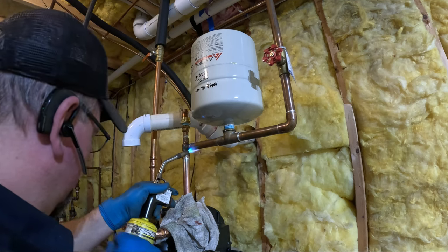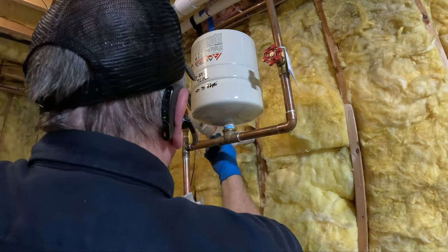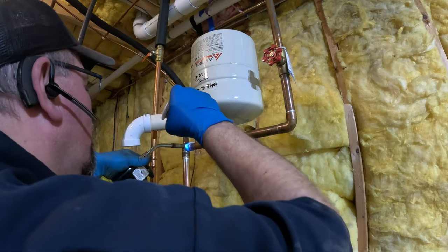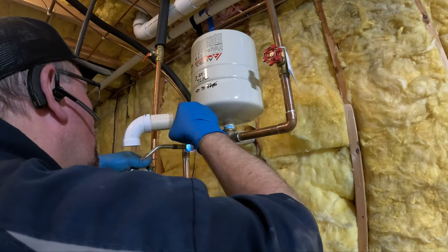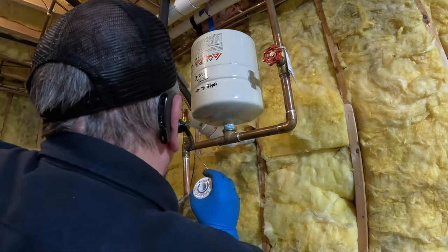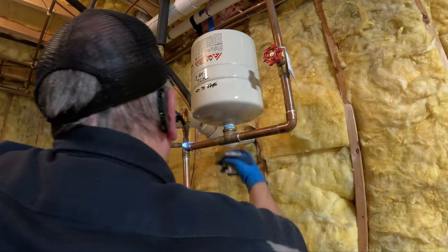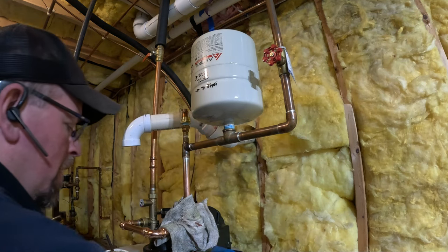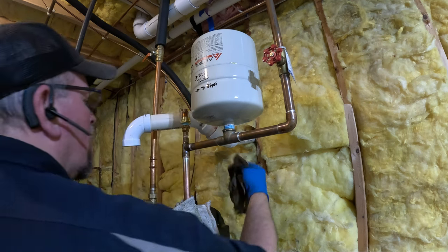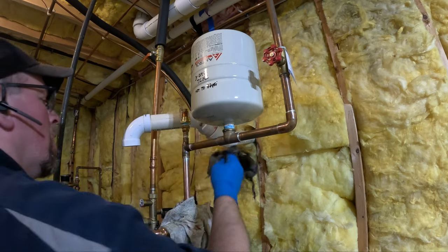Working, you see venting coming out the top there. So if I can flux it and get a little more solder, maybe they didn't have a lot of solder there to begin with. I don't remember wiping any off this when I was trying to take out the other piece. Purposely hitting this with a lot of solder so that it sucks it in. I think that would have been a pinhole leak had I left it.